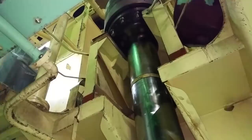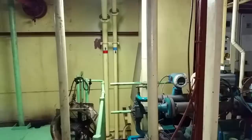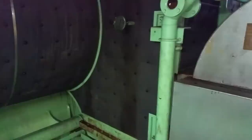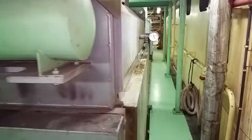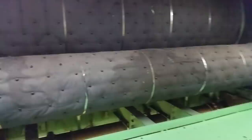This is the blend-on-board unit — a BOB unit we call it. There are two pumps: you have suction from a lube oil sump and an additive tank, and they get blended together to make cylinder oil. This is the number two air cooler, which is the after one. We're going very slow today so it's not really hot — usually the inlet air temperature is well over 100 degrees. The air is cooled through water, with inlet and outlet water lines right here.